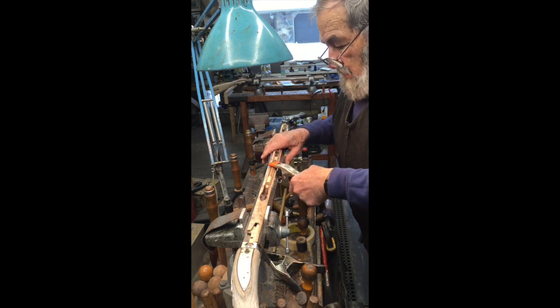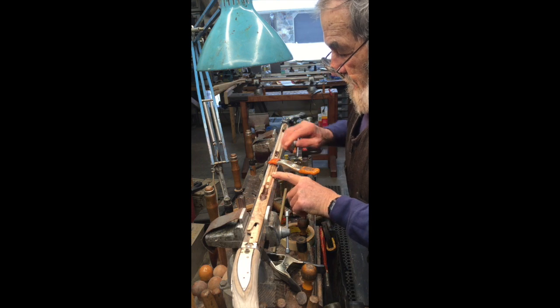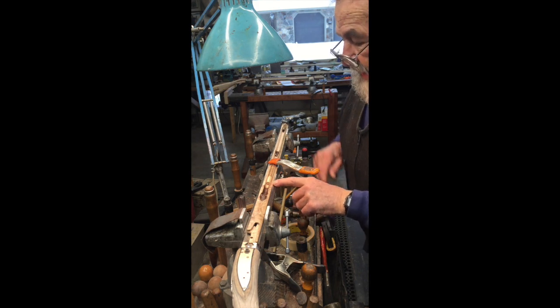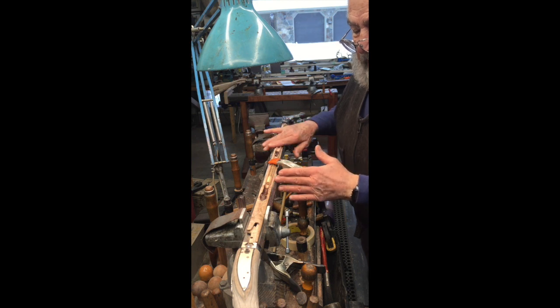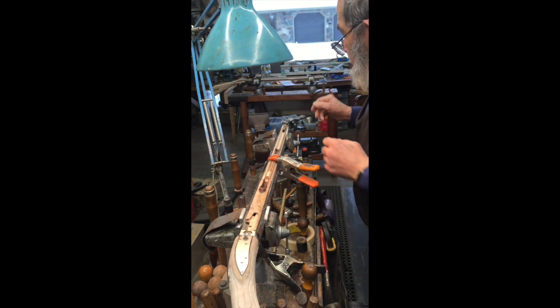And what we'll do, eventually we're going to sand this all the way out to the muzzle end, lowering these edges here by probably an eighth of an inch. But I like to leave it heavy while we're doing all this work of prying it out and glass bedding it in. And I'm going to lift this in here so I can get the sandpaper on it.